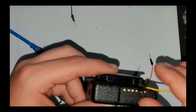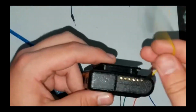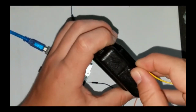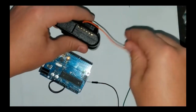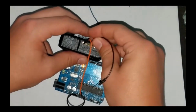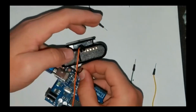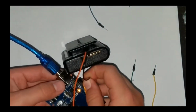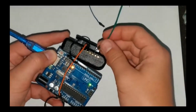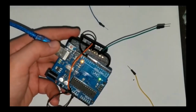Open the Arduino IDE on your computer and connect your Arduino board via a USB cable. For this project, we'll be using the RF24 library to handle communication between the NRF24L01 modules. To install the library, simply go to Sketch > Library > Manage Libraries, and search for RF24. Install it and include it at the beginning of your code.